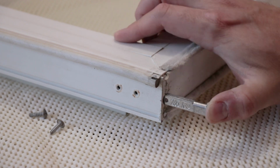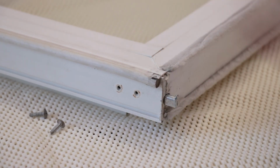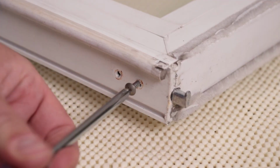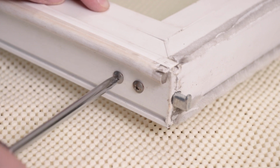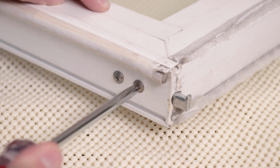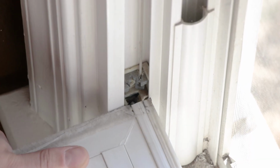To install the replacement, slide the new bar in the same opening and secure it with the original fasteners. Make sure the new pivot bars are installed in the same orientation as the old pair. Complete the repair by engaging the new pivot bar in the pivot lock shoe and tilting the window back into place.